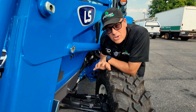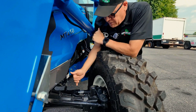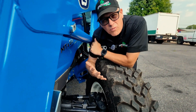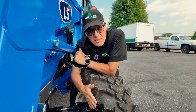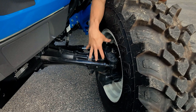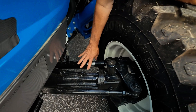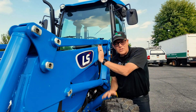Something that's not typical with a tractor of this size is that it has a bevel gear front steering mechanism to apply the four-wheel drive to the tire. The shaft comes over, there's a shaft that goes down in the bottom, and there's a bevel gear. What that allows is very tight turning. One of the problems with four-wheel drive tractors is that it takes a country mile to turn them around — not with this tractor. This turns basically as sharp as a two-wheel drive tractor. Also notice the power steering cylinder back here and how beefy that is, built to withstand the 3,000 pounds that you can put in the loader.